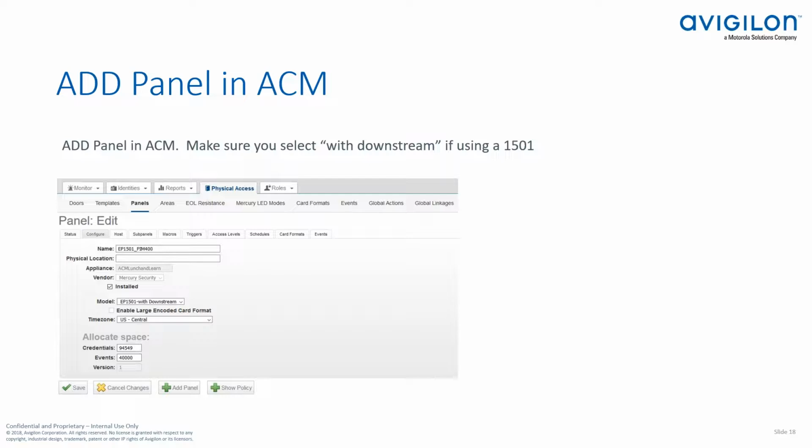I would make sure you buy an HHD device for each location where you're going to deploy these, and leave that device on site somewhere that it can be easily found. Because if you do need to make changes in the future, such as update firmware, or if you need to get diagnostic information from the lock, you're going to need that HHD device.